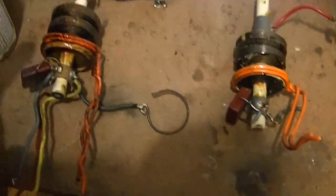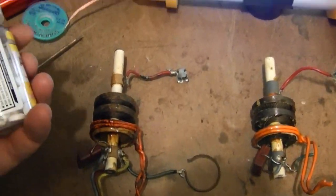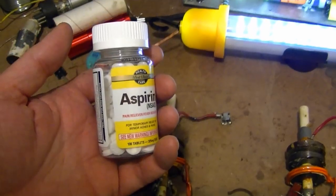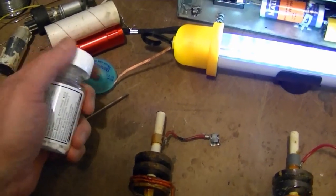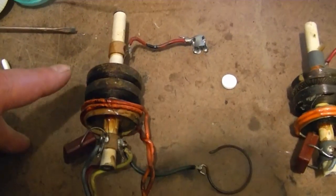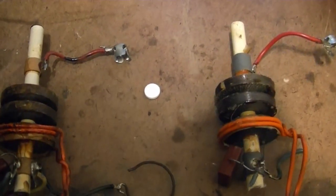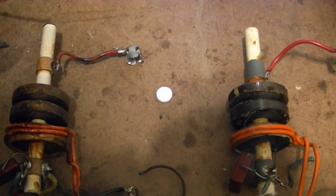However, there is a trick that I wrote about online that will aid you in repairing these fine wires if they break. I didn't believe it when I read about it but I did give it a try and it does work. I warn you — it produces some really nasty fumes; you've got to have a fan going and good ventilation. What you do is use aspirin — not ibuprofen or any other substitutes, but genuine aspirin. Take your tablet, take a piece of very fine enameled wire, lay it on the aspirin, and touch your soldering iron tip to it. That will melt the aspirin and dissolve the coating off the wire, leaving you with a nice clean bare wire.